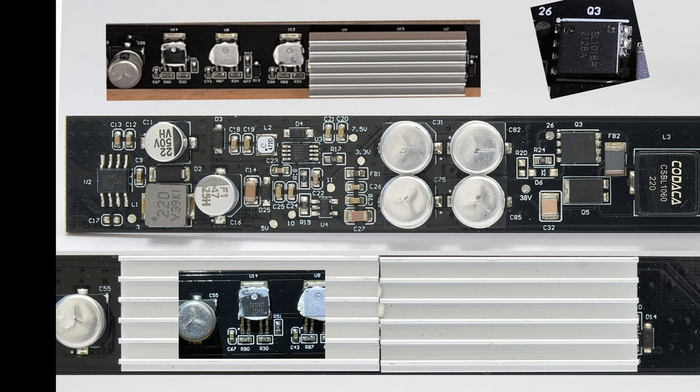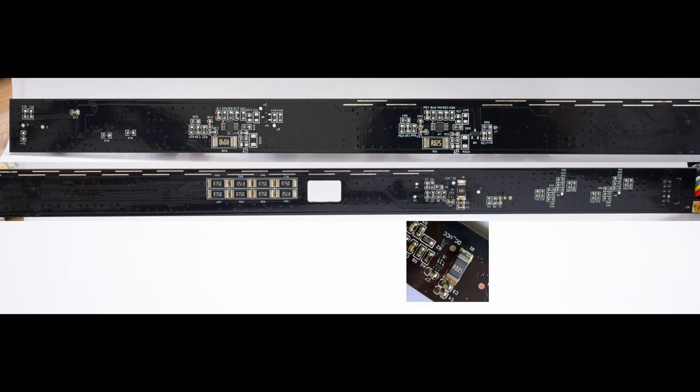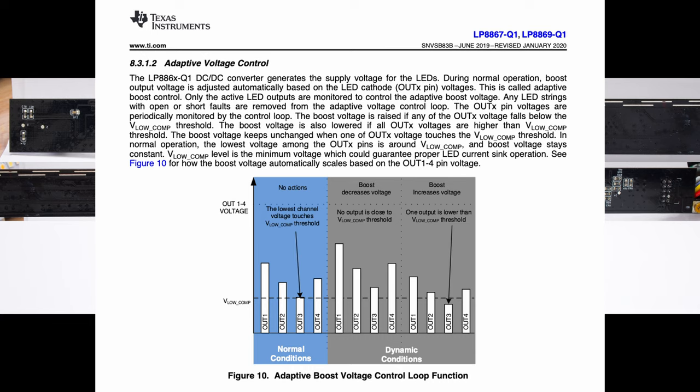Under the heat sink, there are six SM15106T constant current LED driver chips used for linear current regulation, and they can be switched on and off using PWM for dimming — 3 to 80V DC, maximum current 1.2A. On the back of the PCB, we can see two strings of 3-ohm total resistance used in series with the LEDs to help dissipate heat evenly with the LED driver chips. The LED driver adopts a constant voltage supply followed by linear constant current regulation with PWM dimming. PWM dimming is preferred for color-accurate lighting because white and color LEDs may show color shifts when dimmed by reducing the current. However, because unlike chips such as the TI LP8867, this LED driver does not have adaptive voltage control, which changes the output voltage of the boost converter to reduce the voltage drop in the linear regulator or resistors, increasing efficiency when dimming the LEDs.